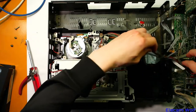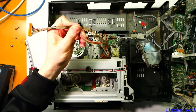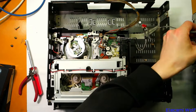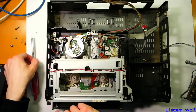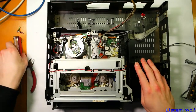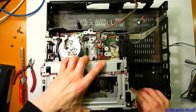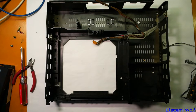Now we can get this wire out, which is the head drum motor — the shielded ones for feedback since that's high frequency, and brown wires. So this is the good electronics, we're going to keep that. I thought we were replacing this — oh, there's that screw. I guess we're just dismantling everything. This wasn't really planned in any way; I just started recording after putting the VCR here and we're working it out as we go along. That is a good mechanism — now that we're pulling that out, we can keep this wire. We'll put that aside and grab the other one we're going to investigate.